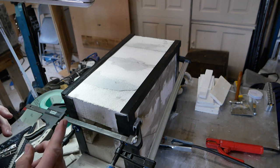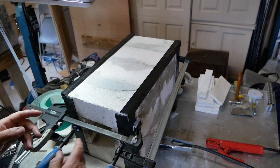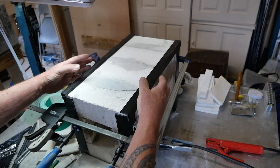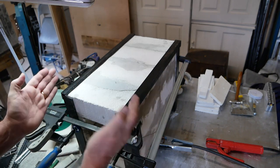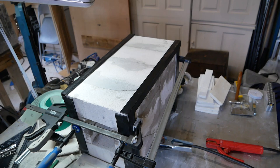There is also a feasibility that I will put the control box on top, which might be an even better idea because I've actually got space this way and it saves a lot of sideways space. So that's going through my head as well. And then the other thing I'm going to do is I'm going to put... Actually, that's even a better idea because then I can put the braces across this way, which will solve the warp that's happened that way. So that's what I'm going to do now. I'm going to start welding these pieces up.